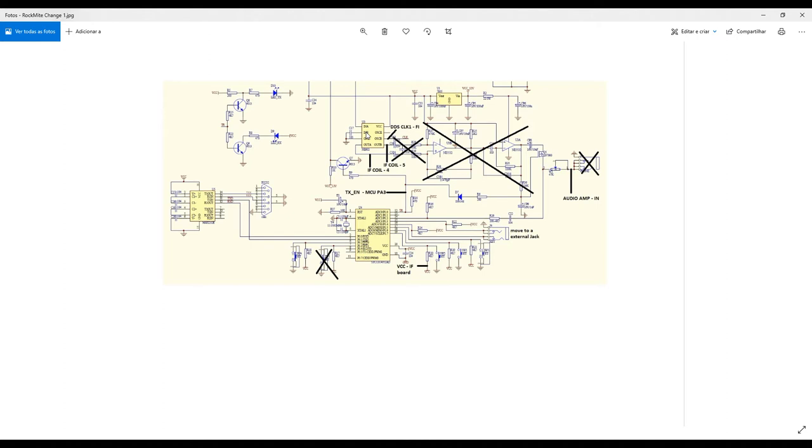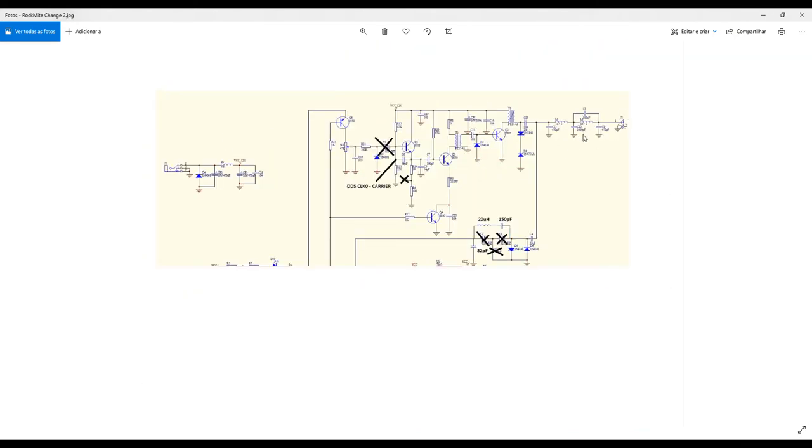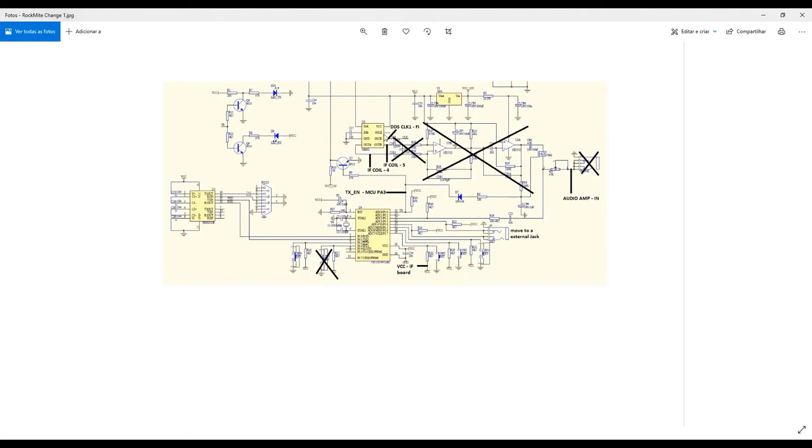And you have your signal in this output here, let's say the audio from the input signal. So if you have here a 7 megahertz signal and you want to convert this signal to the audio range of frequencies, you come with the 7 megahertz signal here. You just have to mix it with a 7 megahertz signal here. But you have some other components coming out from your mixing, okay?